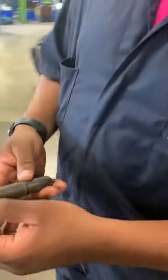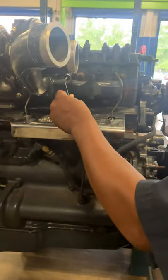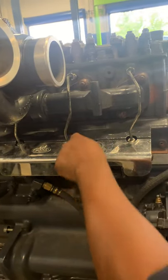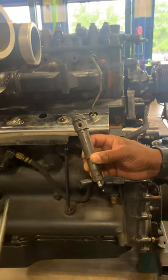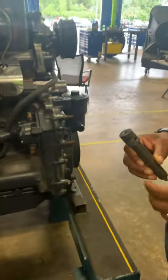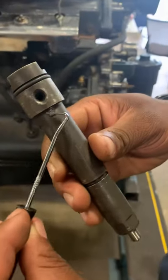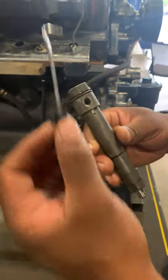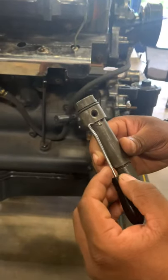Check it out. So when you reinstall it, you got your fuel line, your fuel deck — it installs right here, just like so. When you install it, it installs inside of the nozzle just like that. Right up under the nozzle — in the nozzle right here, this is a guide. It's supposed to be sticking out but it's not — it's damaged. So like I said, I would replace the body, I would replace this whole nozzle. This guide sticks out, so when you're replacing it and putting it back in the engine, you've got to make sure this guide falls into the slot that's built inside of the engine.